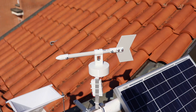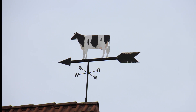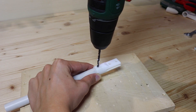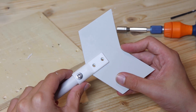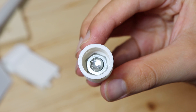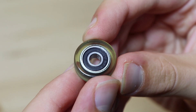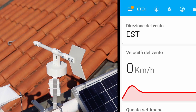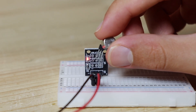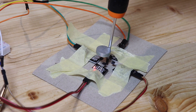Then we have the wind vane, which detects which direction the wind is coming from. It's a bit of an evolution of the classic wind marker that we use to put on roofs. Even for this one I had to make some parts with the 3D printer. Now we are seeing in the video that I built it in 30 seconds, but in reality it took more than a week. The wind vane has an arrow piece at the back and the tip at the front, with a bolt in it as a weight to balance the wind vane. The wind vane can rotate freely with the ball bearing I put in the base. To detect the 4 cardinal points of the wind I will use 4 hall-effect sensors, which are magnetic sensors that are activated when a magnet approaches. My idea is to put them with the magnet spinning and activating the sensor for the cardinal point the wind vane is turned toward.